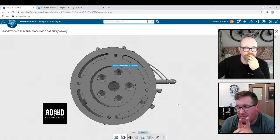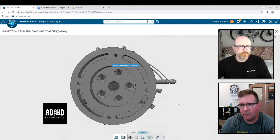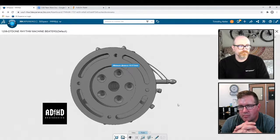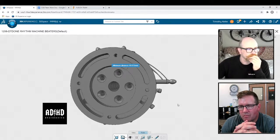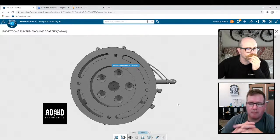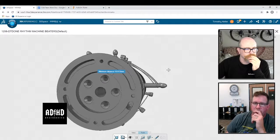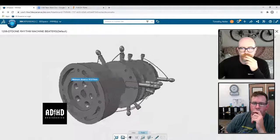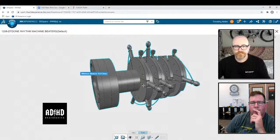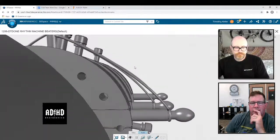That said, the best way to check that everything is the right size would be to bring in the IGES and overlap them and look for deviations. That's very easy to do. When you have an assembly finished, just import the IGES into the assembly and overlap it. If the IGES pops out, then something is wrong.